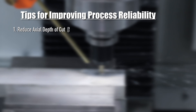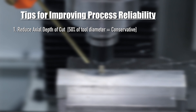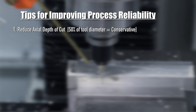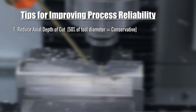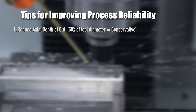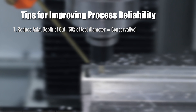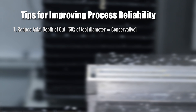Number one: reduce your axial depth of cut. To be conservative, you could do 50% of the tool diameter. So if it's a quarter inch end mill, you're going to slot down 0.125 inches. That's going to massively help with chip evacuation. You've got less chance of recutting those chips, because every time you're recutting a chip you're generating extra heat, and that heat is going to potentially build up and cause chip welding. Cutting at 50% depth of cut is probably not your end goal, but I'd always recommend starting with a recipe that works — one that lets you learn how the material cuts, how the machine sounds, and how chips are evacuated. Then you can start to increase. It's much more educational than the other extreme, which is immediately breaking a tool.